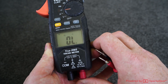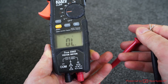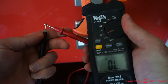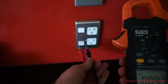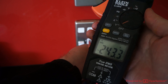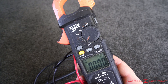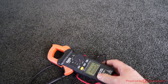The first things to check are that the leads are actually plugged into the meter properly and that the batteries have been replaced. If it still shows open loop, you might go to a power socket — even though the meter is not working on continuity, put it on voltage and test a known live power outlet to show the meter still reads 240 volts. Sometimes people jump to the conclusion that they've blown an internal fuse and go buy a new meter just to do their job.